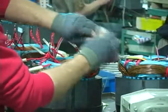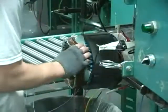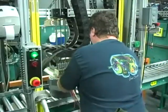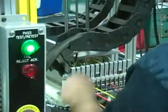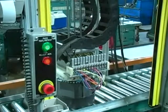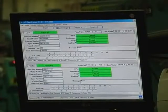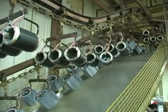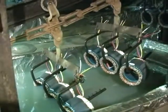Winding leads are connected and brazed on larger motors. End turns are laced between each coil and end for long winding life. Stator tests include resistance, shorts, and high pot. Every stator is preheated, varnish dipped, and baked to bond the wire and prolong motor life.